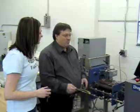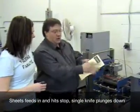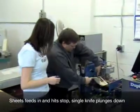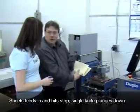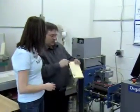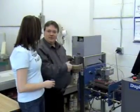Here's the other style of mechanical folding: knife folding. This has to be on the end of our booklet maker. We use it because it's cheaper for customers to mail something folded down to 5.5 by 8.5 than flat. The booklet is made, comes out of the trimmer, goes up between these belts, hits the stop, and straightens out. Then the knife comes down and pushes it between two sets of rollers — similar to the buckle folder, but by having the knife push it down, we can handle a thicker product. The rollers on this one are carved out on the very end so they don't tear the staples out.